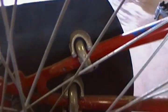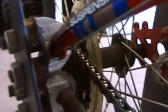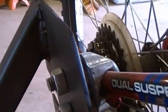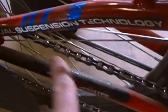Actually, I think they're cable clamps used to tie off steel cable or steel wire. And I kind of estimated where I wanted it to be. Clearly I have to clear the derailleur back here, and make sure I can shift all the gears. So you'll see I use some shims here, which are basically black iron pipe. And put it all together. Made some adjustments. Again, each bike has a different angle here and here.